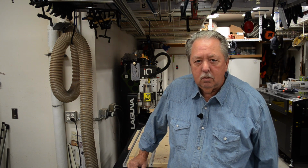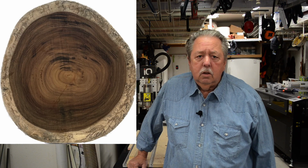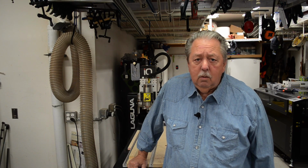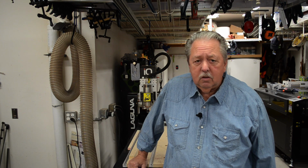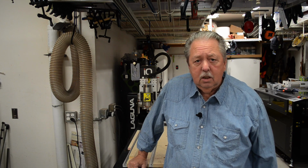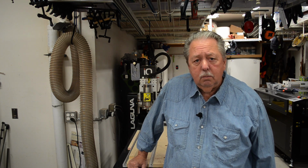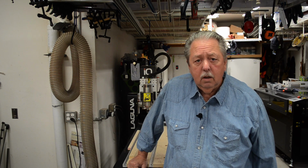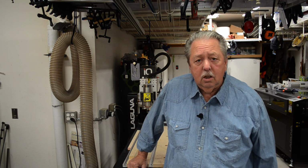In this case, I'm using vCarve Pro. In this video, I'll be discussing just how I took a cookie. I had designed it in vCarve Pro to put a multicolor sign on it that I will be demonstrating throughout a series of videos, and set it up so that I could carve the sign exactly the way I designed it in the software. Not only that, I had the extra added challenge of ensuring that I could take that sign, that cookie, on and off my CNC because I was making it a multicolored epoxy sign, meaning I had to put on successive layers of colored epoxy, and so therefore I would carve into the epoxy before. So each time it had to be located on the CNC in a very precise manner to ensure the carving turned out right. Following that, I needed to surface the cookie to get it ready for the carve.